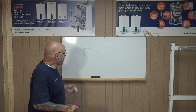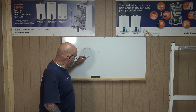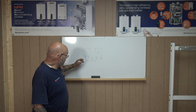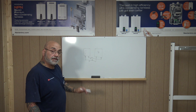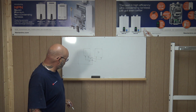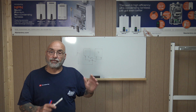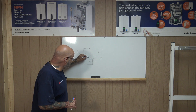Most of the time what I see is they have two pipes coming out the middle — cold water here, hot water here — and they go left and right to each unit. What's happening is this one tankless is going to work the most; it's always going to fire on demand. When the hot water pipe draws water to the building, that one tankless is going to work every time. There is no way to get around it — it's drawing water from the best source — and this will happen even if you have the communications cable, the cascade cable, going between them.